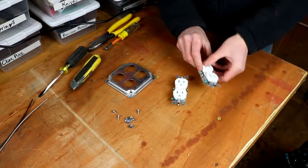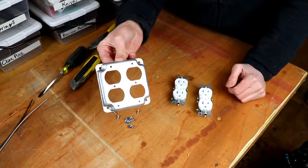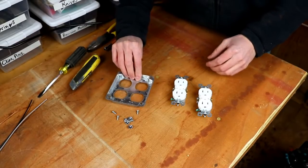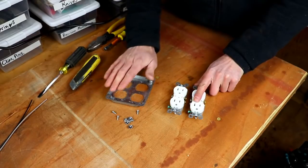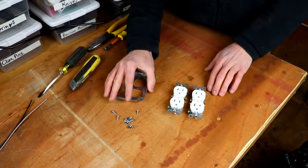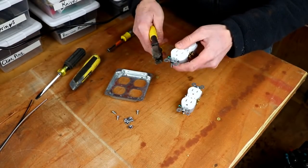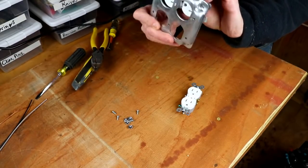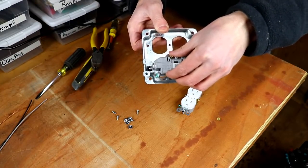Let's start off by looking at what parts we need. I purchased this duplex receptacle cover. I'm going to be using a metal box, so I'm going to use this metal cover. We're going to wire these two outlets together and mount them on this cover plate, then mount the whole assembly on our box. We have four tabs on the four corners of the outlets that need to be broken off — those tabs won't allow the outlets to mount how they need to be.